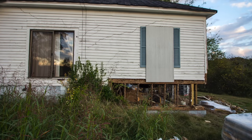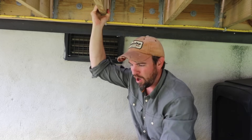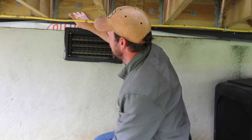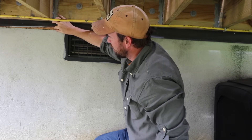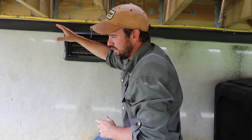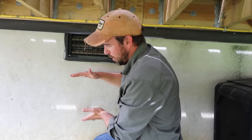We would jack the house up. The jacks we were using were just your typical car jacks — a little hefty, like truck jacks, two tons, four tons. Sometimes we'd use boards to brace as the jacks would push up. You only have to get the house a few inches above the foundation to really do this. We were basically jacking the house up from the inside so it was just a little bit above the foundation, taking the weight off the piers. Then we would tumble down the piers in that section and start building our foundation wall.